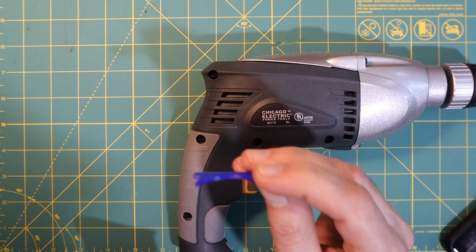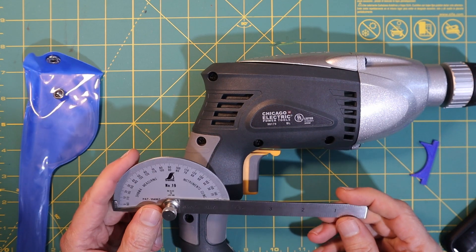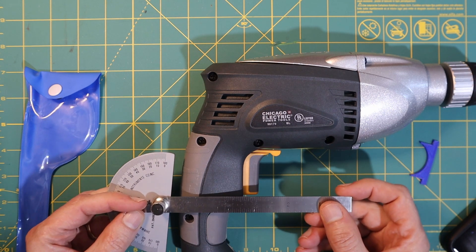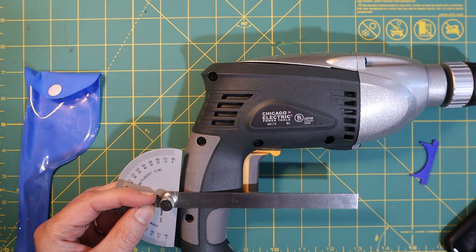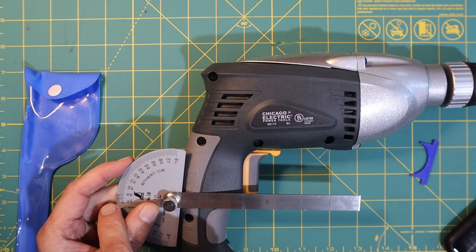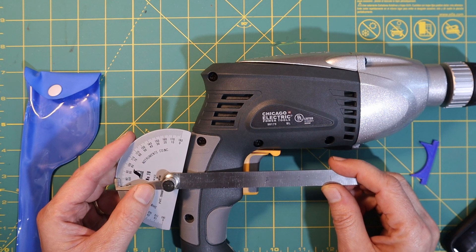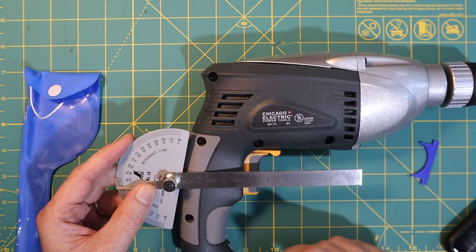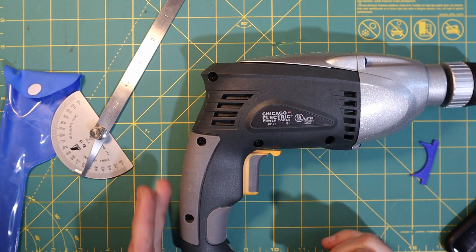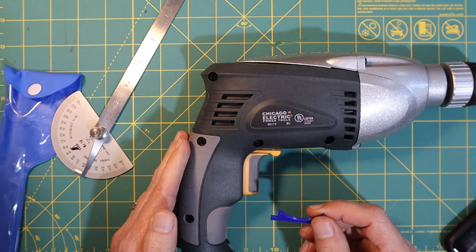For the angles I used a simple protractor. I tried to make this horizontal and then eye down to see about what the angle would look like — it's on the order of five or six degrees there. Then if I go to the top and look at this angle it's on the order of 12 degrees, so that allowed me to create a control curve that will allow the loft to be curved this way.